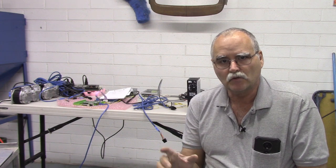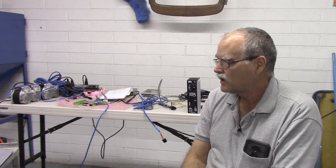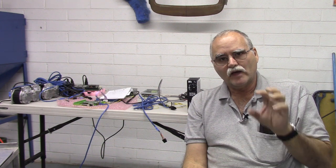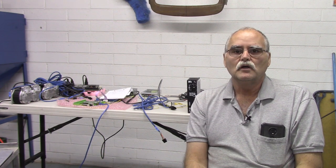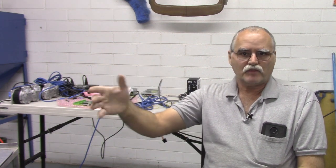What I'd like to do first is get Acorn and the CNC PC communication established with the ethernet cable, get it configured so you can fire up CNC 12 and talk to Acorn. When you can see the CNC 12 screen, that means you have communications established - that's the first step. The second step is to put one drive and one motor on Acorn and get that motor turning. Then add subsequent motors - two for a lathe, three for a mill, four if you have a fourth axis.